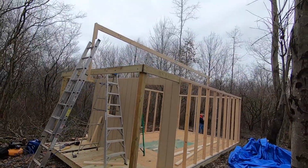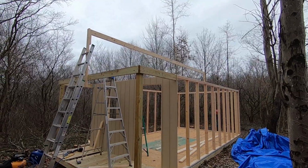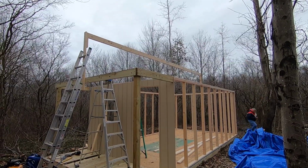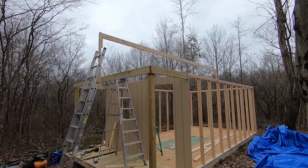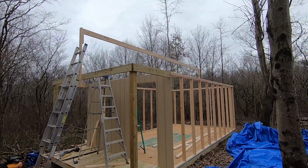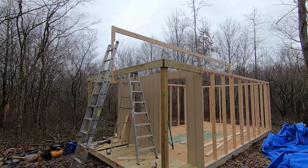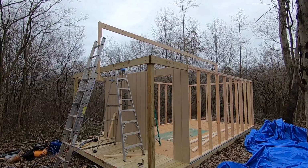Here's the beam. I used 2 12-footers and used thick steel plates on both sides rated for structural. And there'll be additional bracing across the middle. That's just kind of to hold everything in place. So now it's time maybe to get some rafters started.